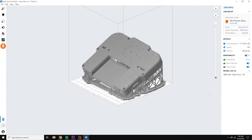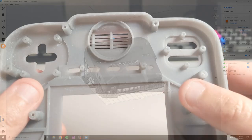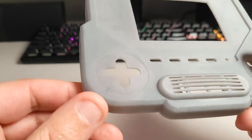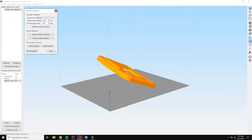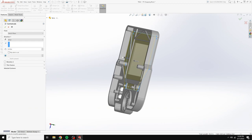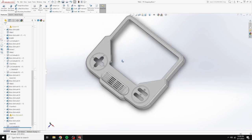However, the whole case was originally designed around SLA 3D printing in mind, which meant the front and back halves were two solid pieces — really not ideal for an FDM 3D printing approach. So instead of trying to print with odd supports or at weird angles, I took the approach of surgically butchering my original case files to break them into FDM printable parts.